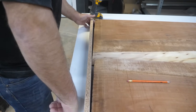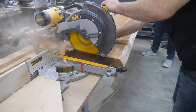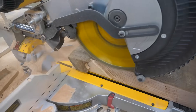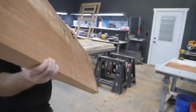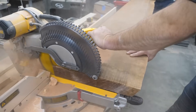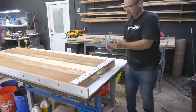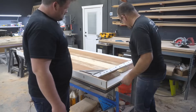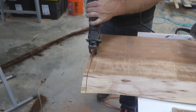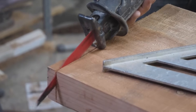These cuts are pretty non-square so I'm going to cut them on that chop saw. Use whatever method of cutting creates the safest, most predictable cut. In this case I'm flipping the river table piece over itself so I can finish the cut — it's a pretty big piece but the chop saw plunges all the way through. When originally cutting my slab to size, I left some meat on the bone — this is a perfect example of why that's important. I get to true it up as I go, so I get some allowance for imperfections.